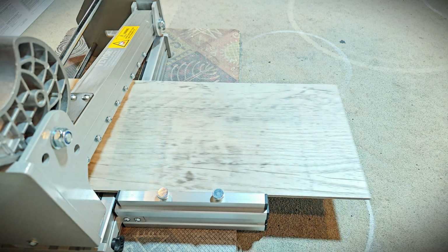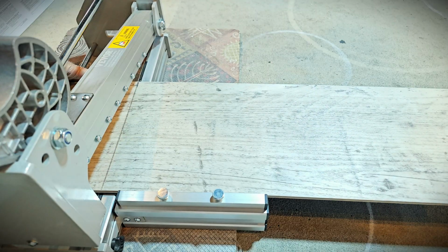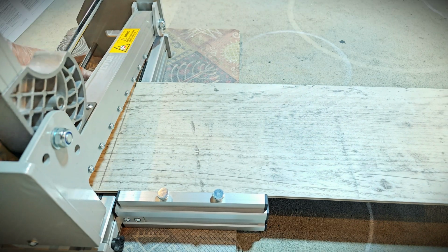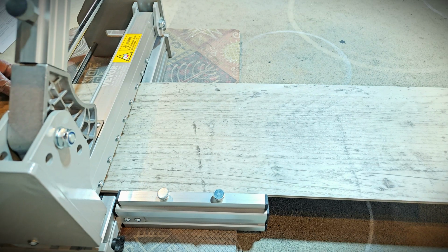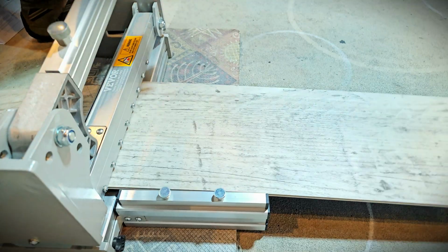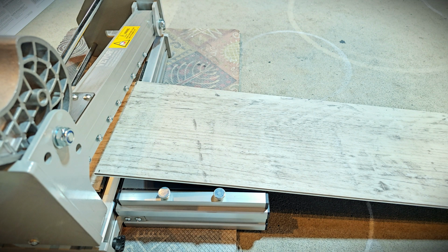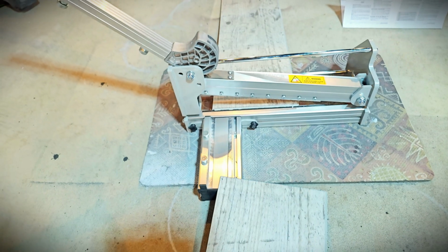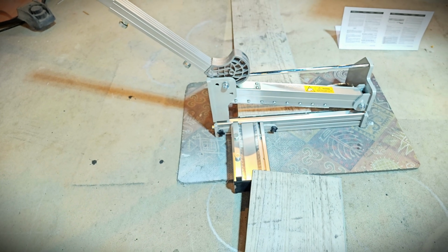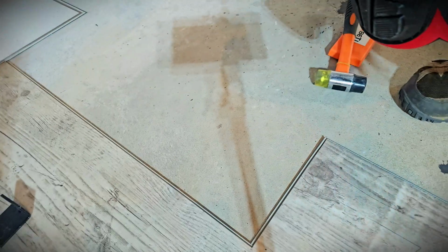Isn't it amazing? Simply slide in the plank under the cutter's blade. The edge guide keeps the plank perpendicular to the blade. Apply slight pressure on the top lever and click. It goes like a soft chocolate chip cookie. This is how the tool looks. Though I didn't get a chance to sharpen the blade for my 1500 square feet area of flooring, it comes with a blade sharpener as well.